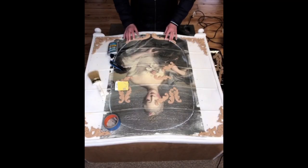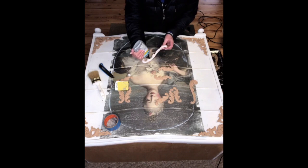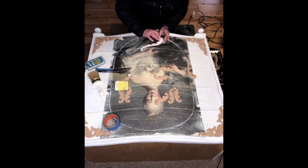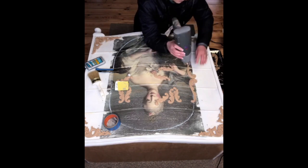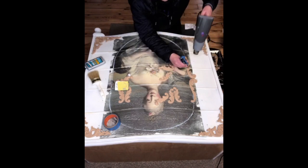Like many furniture upcycling projects, when the first mouldings were being applied, Solly began to realise the size of the task in front of her. Notice how she's covering all of the back of the 723 moulding in wood glue to make sure it sticks. Heating up the mouldings also helps them to adhere better.